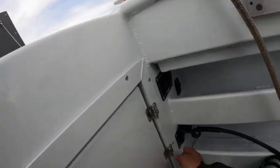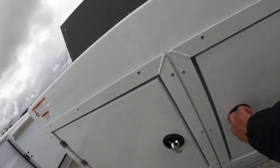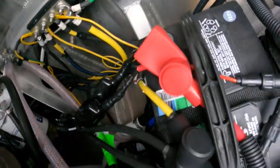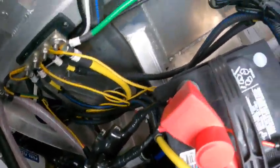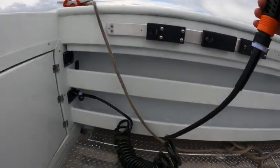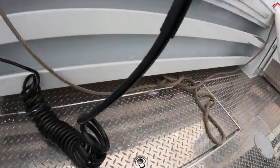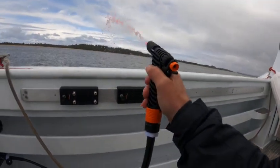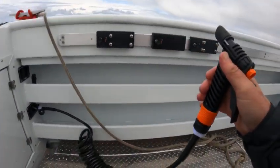I hear the pump. Okay, so if you hear the pump going and you come back here, you got a seacock valve which is open, so we should have water coming out of that. There it is — see, the valve, hit it on. That's antifreeze now. It's still filling up there — I heard a little bit of a leak somewhere, just tighten it up right there.